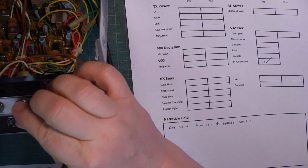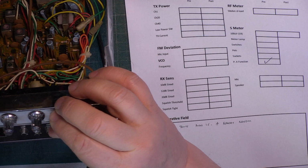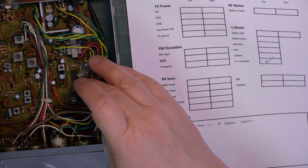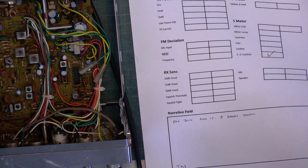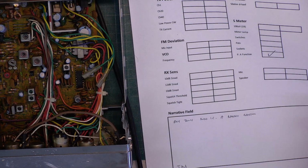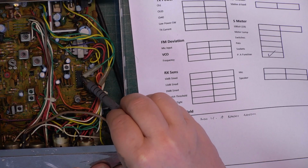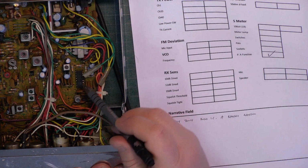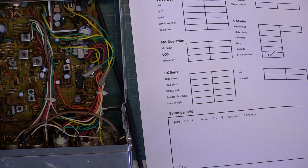Right, we'll go into normal CB mode. Squelch down, it is down. We don't have a normal FM hiss. That can be because the squelch on these sets sometimes doesn't open if there's no signal whatsoever. Sometimes it can be adjusted, sometimes it can't. So when you get the fake version of this chassis, the squelch is what usually is the letdown. It's part of the LA1230, which is this Sanyo FM chip. It was designed for hi-fi stereo tuner amplifiers, and so when you tune between stations it mutes, so you don't get that FM hiss. So it's an internal part of the integrated circuit, and it's used as the squelch, because in two-way radio, mute is squelch.